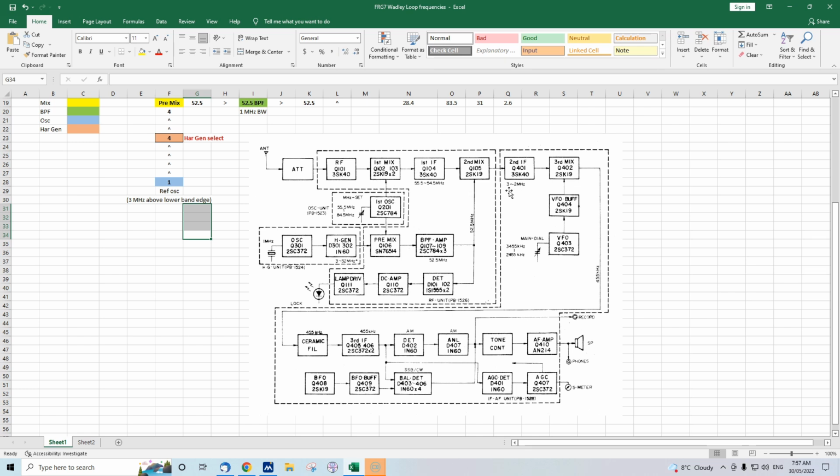Very, very ordinary. The incoming signal is 3 to 2 megahertz. The reason why it's written backwards is the mixing process. You are taking the difference between the VFO frequency and the incoming signal here. The VFO frequency is actually higher than the incoming signal, so you're subtracting the incoming signal, but your difference is always 455 kilohertz for the intermediate frequency, where it's then detected and demodulated and amplified. So right here, the back end of the receiver is just a very ordinary single conversion receiver that covers a 1 megahertz range from 3 to 2 megahertz.